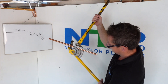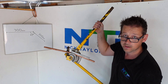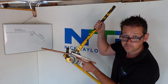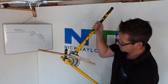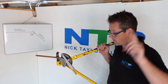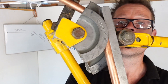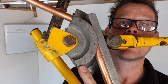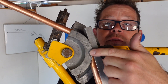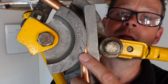Then give it a bend. Now we're going to bend it all the way to the 45 degree mark, which is the two marks already on the guide and the former here. You've got your marks — that's a 90 degree bend and half of that from here to here is 45 — and I'm going to aim that pipe so it's pretty much in the middle of that line there.